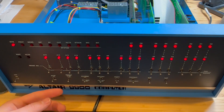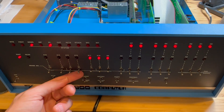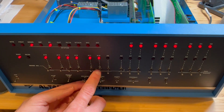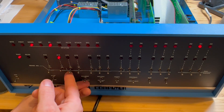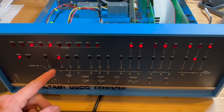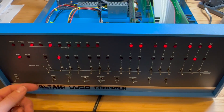After a full reset, I want to see if maybe some RAM chips are just gone while others still work. Testing the upper chips, they all seem to show the same unusual value, which doesn't look promising. Toggling the upper address lines A12, A13, A14, A15 — A14 shows something different. A14 definitely has something responding. So either the lower RAM chips are gone, or there's some configuration that needs to be changed on the RAM board itself.